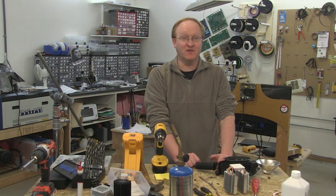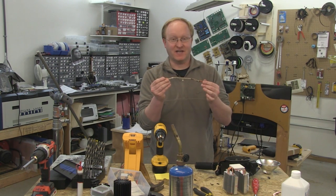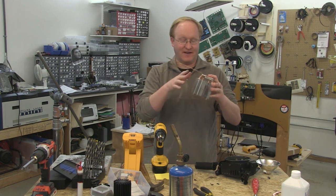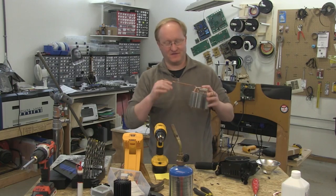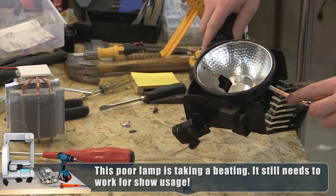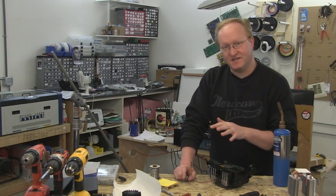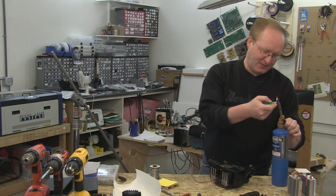Felix and I searched around the shop and found a few heat pipes. Heat pipes basically conduct very well — they'll take heat from one side and transfer it to the other. What I think I want to do is put this very close to the lamp and then connect it to this heat sink that has the Peltier on it. That way this side will always be hotter since this has three heat pipes versus one, and hopefully this will do a better job cooling. So I removed the reflector and took the lamp apart, and I want the heat pipe to come down right at the heart of the belly of the beast. I need to figure out a way to affix this in place, and then we're going to attach the heat pipe to a copper plate and attach that copper plate to the Peltier for a really good thermal connection — and we're going to solder that together.